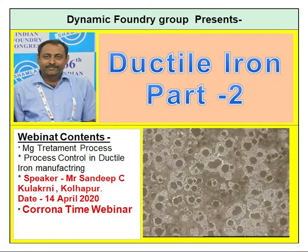As I told you, magnesium is a lighter material, so it tends to float on the metal surface. That is why it is more in contact with oxygen, so recovery of magnesium is less. To increase the recovery, wherever possible, you use covers, a cover on the ladle or the tundish, so that your magnesium recovery will be higher. Magnesium will not come in contact with oxygen. This is how, with time, nodularity goes down, as well as the inoculation effect.